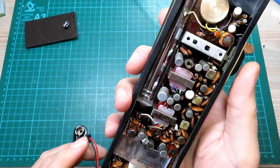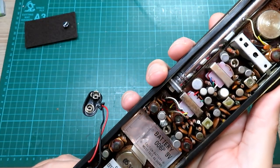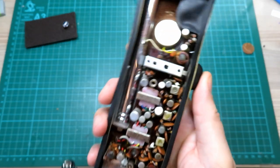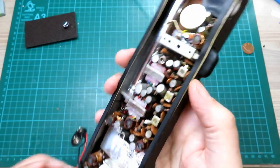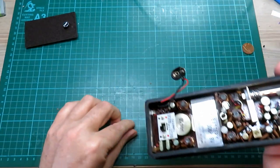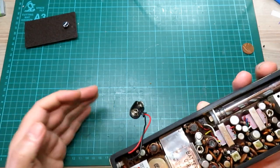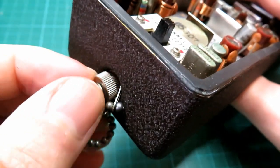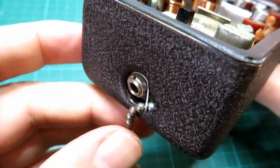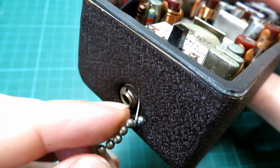So we will do a field test with this I think, but what I'm going to do off camera is just do a bit of cleaning up, and then we'll do our test and see how it performs. This is a lovely vintage thing and if it's working - you can see the bits of foam are falling out of it - I don't really want to disturb that, I want to leave that in the radio if I can. And you'll notice underneath this little bath-plug type arrangement, this little screw cap, we have a 3.5mm jack for the audio. I've just given that a bit of a clean with some switch cleaner.